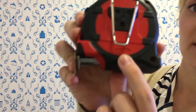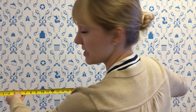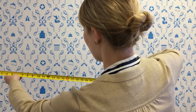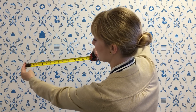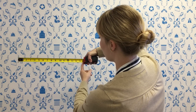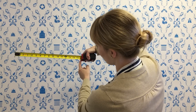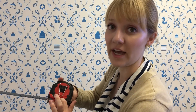Number five: on some tape measures, you'll see that there's a little measurement on the back — this is actually the width of your measuring tape housing. If you're measuring inside a window or somewhere you need to measure into a corner, instead of bending the tape measure and guessing at the curve, you can get a perfectly accurate measurement by putting the metal piece right against the window frame, measuring to the edge, then putting the base of your measuring tape against the other side to find your measurement. In this case it's 16 inches, and then you add the width of your measuring tape housing — so that's three and a half inches.